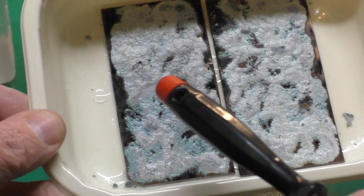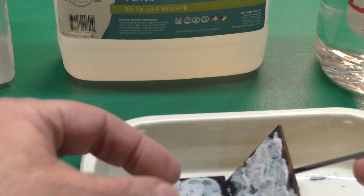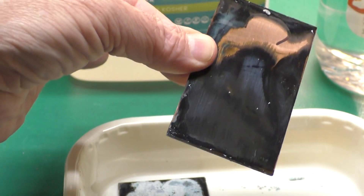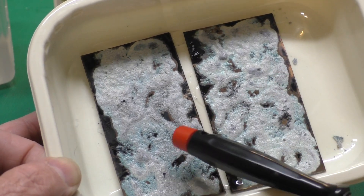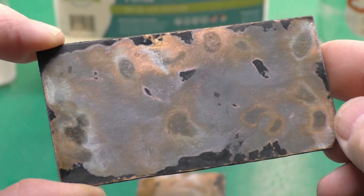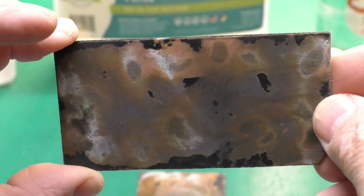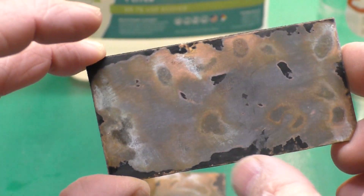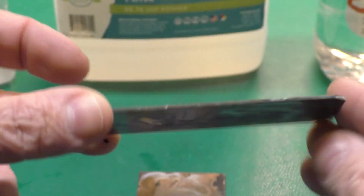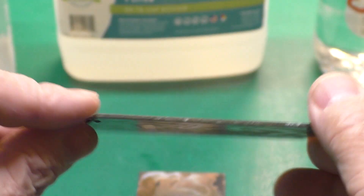While it took a few weeks to start developing green crusty growth, what really surprised me is that the back of the board developed a lovely black patina in just a few days. Comparing the top side — which had the battery smears on it — it doesn't look as bad; it's definitely corroded and there are spots that are worse than others. The spots that were more bare turned very dark black, and the bare back side was very black. So we'll run our experiments on this black side, which experienced the worst corrosion.